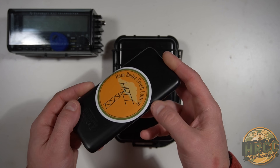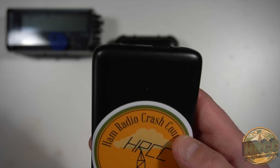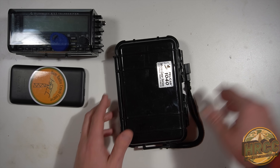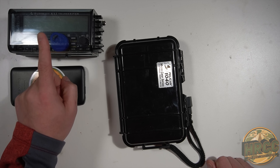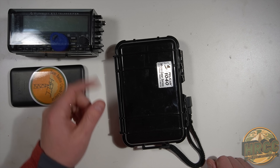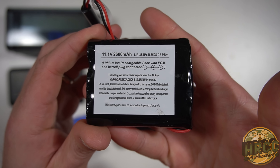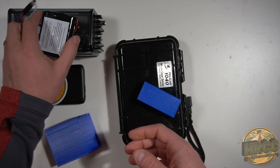The battery bank is the Anker PowerCore — this is a 10,000 milliamp-hour model. I got it because it was thin; that was the primary reason, but you can go with a big fat one if you want. There are other options too: if you get a buck converter that can convert DC to something the Raspberry Pi will run off of, you can pull power from the radio. If you're using an external battery or the extended KX2 battery pack — which I recommend — the KX2 has a lithium-ion battery pack, and I generally run the radio off the internal battery and bring a backup just in case.